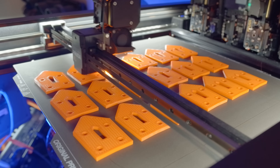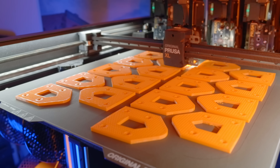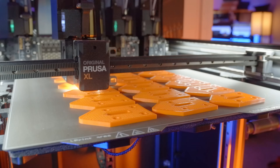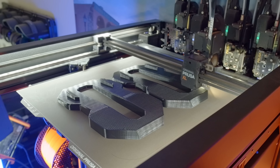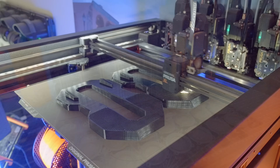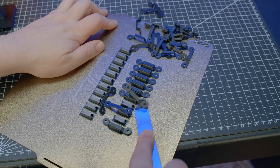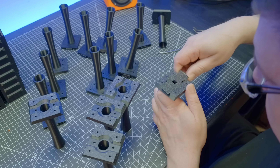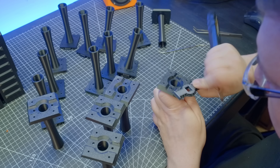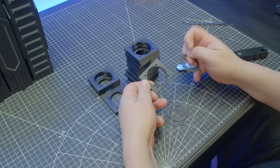Across the way, I have the XL working on all the orange bits. This is by far my favorite orange PETG, printed with 4 perimeters all the way around, 40% gyroid infill along the middle, and the same for the 4 legs as well as the 2 wedges, this time in jet black. One of the things I like about the Bambu Lab filaments is how well the interface material works with flat undersides, especially over these inset areas and little channels for the reusable adhesive.